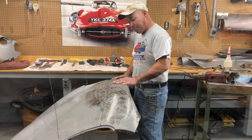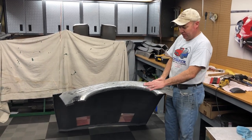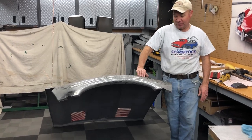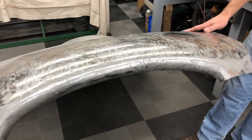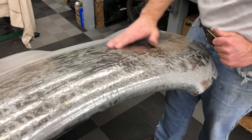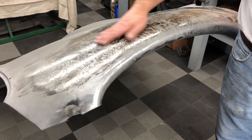So at the very end, we're going to scuff this with a 40-grit disc on an angle grinder with a flat pad behind it, just scuff that shiny surface all down. But we are not going to use that to smooth it — we're doing the smoothing now. That will smooth it just a little bit, but we want to keep going on this until we've got it as smooth as possible. We're coming down the home stretch on the shrinking. I've been at this now for about another hour and a half since the last video, alternating shrinking and hammer and dolly. Right here was a high spot — that's where that lock was, so there was a lot of stretch in there. You can see where this has all been shrunken down.